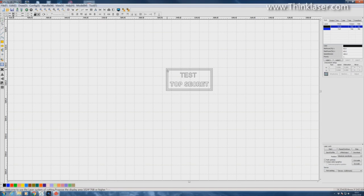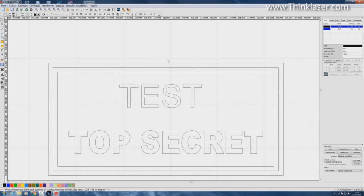And my blue line has disappeared into the background. That's my cut layer. Let's predict how that black line will have affected things. It comes across this black layer first, and so it will engrave between that outer line and this inner line. And then it will not engrave across the next boundary. And then it will engrave everything where my arrow is, which is all this background. And then the next boundaries that it comes across will be the letters, where it will not engrave.